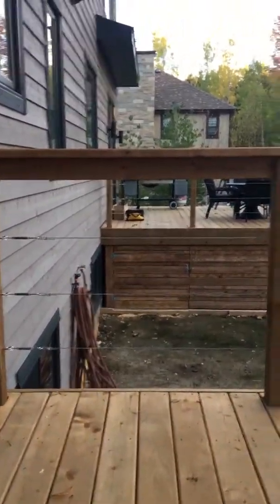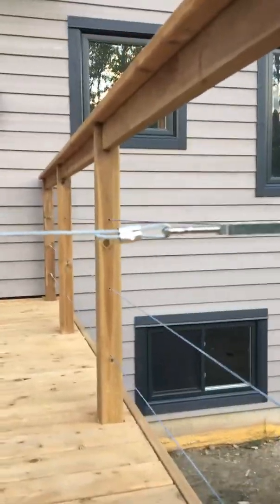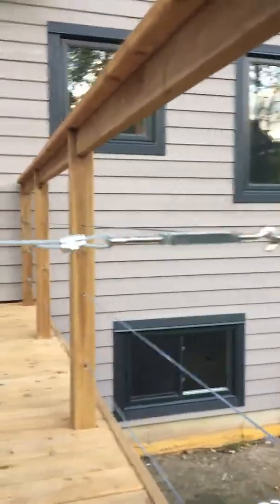I ran this angle on the 4x4 post to get my angle, then centered it at an inch and three-quarter — purely so I can drill for the lag at the same angle the cable should be running. I'll put my eye bolts in there and run the cable just like before. I like having the cut line on the bottom facing away, and if you're really picky you might want to line up the hook end of the turnbuckle away from the deck.